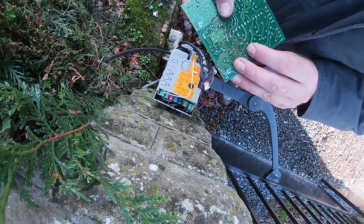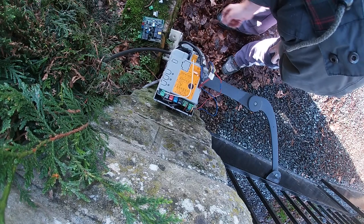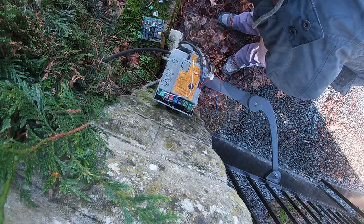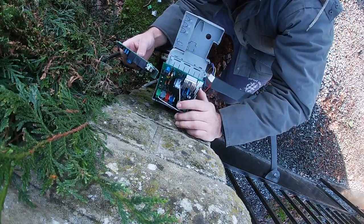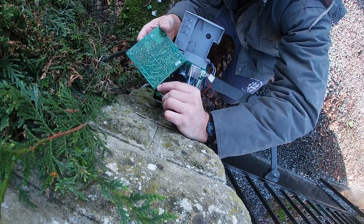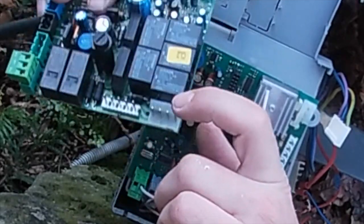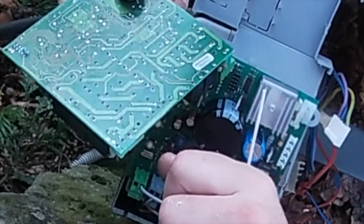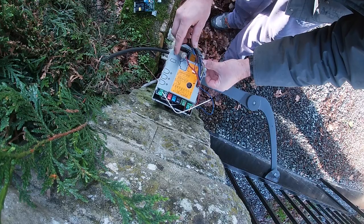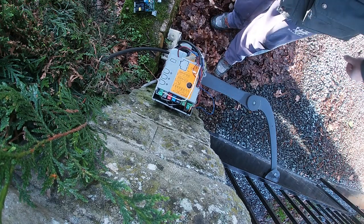The question is what was the extra pin for. Looking at the circuit board underneath the one with four pins, this fourth one here appears to be connected to the third one on this side of the board, because it's a double-sided board. So I'm pretty sure we can ignore that one. Well, what's the worst that could happen — right, I'll go turn the power on.